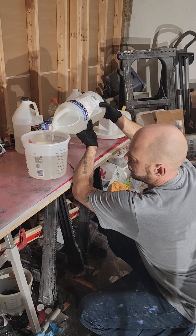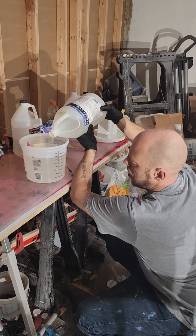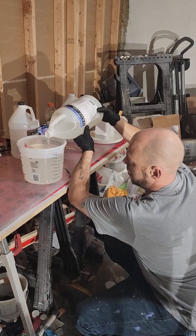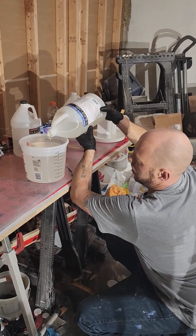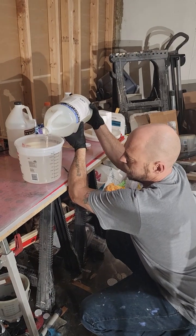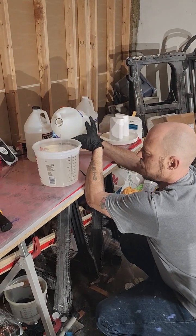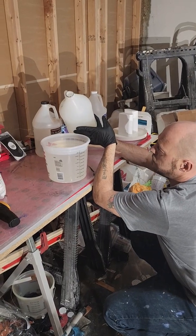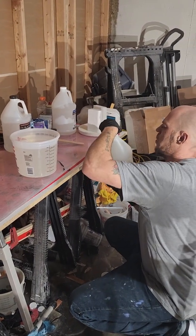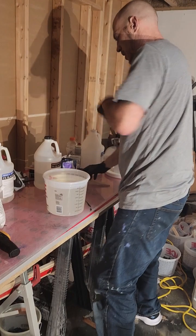Remember, one-to-one ratio — we've got to get up to the four-liter mark. All we're doing is a white base coat, so when this comes out and gets spread over the table evenly, our job is done. All we have left is to watch the drips — they start forming about an hour in, right below the surface of your edge. You can come through there at the time they're starting to dry and wipe them clean, which limits all the sanding.